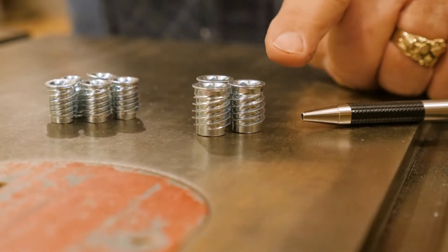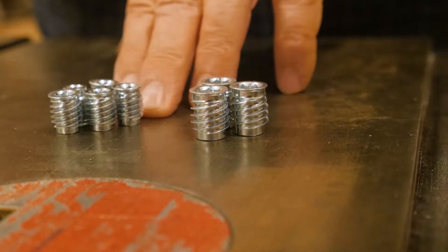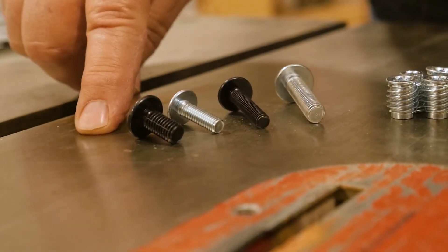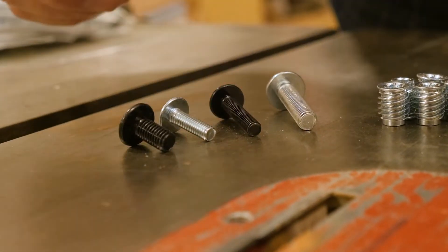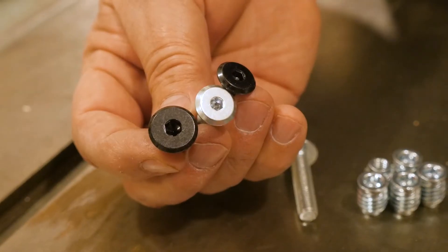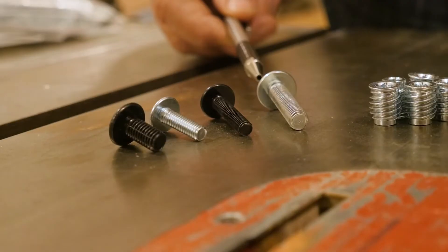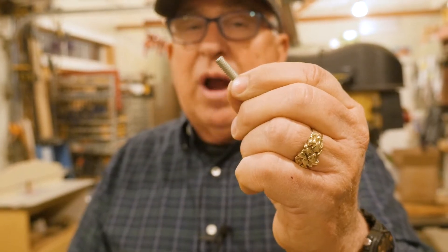You'll be really pleased that these don't back out when you're taking the tool out, and no adhesive is required to get them to stay in place. In addition to offering these great inserts, they also offer a matching set of fasteners in various finishes — zinc, bronze, or black — and they come in three different styles: flathead with a hex driver, a mushroom head with a nice finish, and a panhead, all using hex drivers. Be aware that Rampa Tech offers a full range of these fasteners for their metric line. However, if you're working in imperial, they only offer quarter-20 threads, which is pretty standard in the United States, but you can't get really large or small ones in imperial sizes.